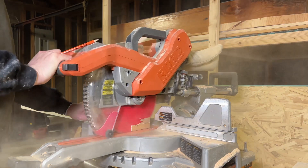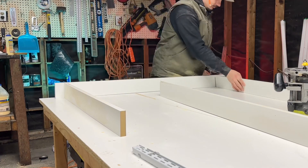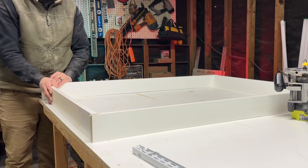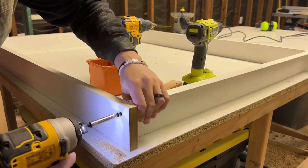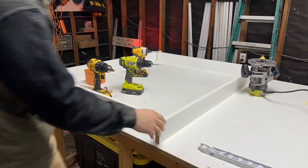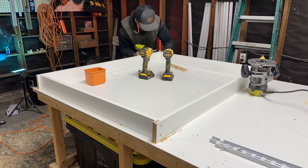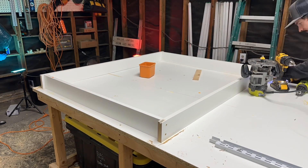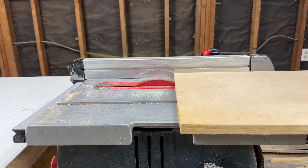I'll start by cutting the side skirts or guide boards — you want four of them. Two will be the same length and the other two the same length, forming a square or rectangle. The key is they're all the same height and the top is very flat. I assemble the rectangle using an eighth-inch drill bit for a pilot hole and a countersink bit. If you're using MDF you definitely want a countersink bit or you'll spoil the wood. The most important part: the top has to be completely flat.